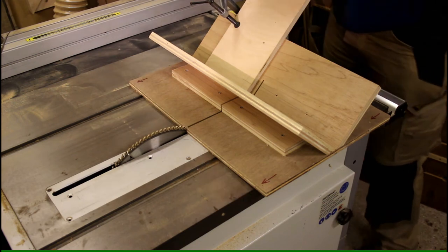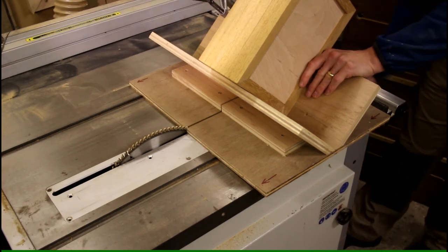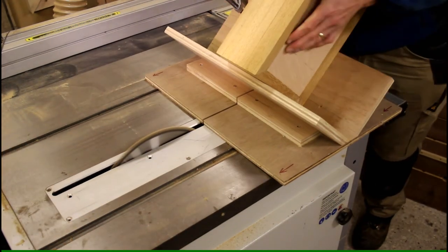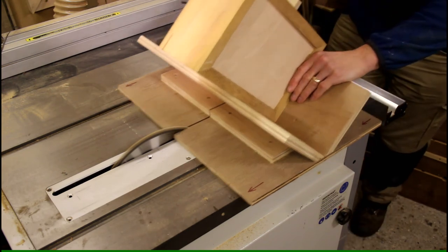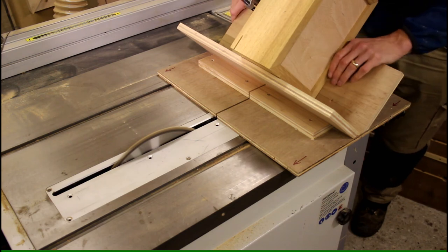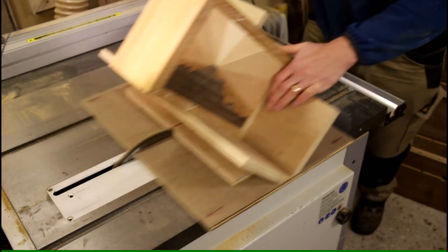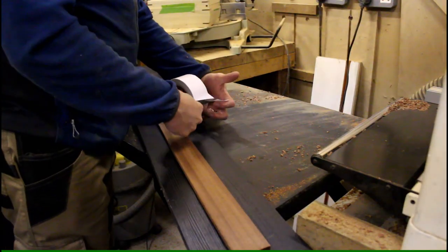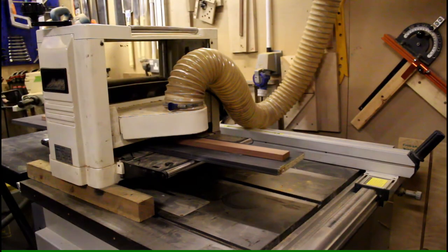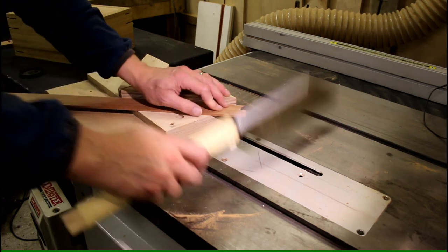I apply glue to all the mitres and fold the box up around the lid and base. I use a shop-made jig to cut the slots for the mitre spines on the table saw. This jig holds the box at 45 degrees to the table and has runners that slide in the slot on the table saw. The box is rotated and the next slot is cut. A stop block is clamped to the jig to ensure that the slots are cut in the same place on each corner. I make the splines by ripping a strip of sapele, taping it onto a flat piece of chipboard and passing it through the planer, bringing the thickness to just over the width of the table saw kerf for a tight fit. I then cut the strip at 45 degrees to create the splines.